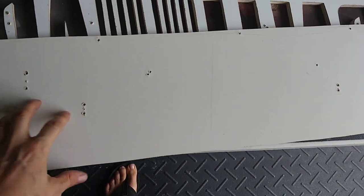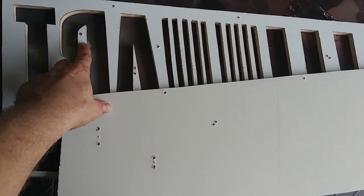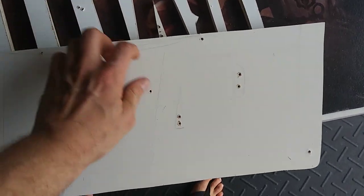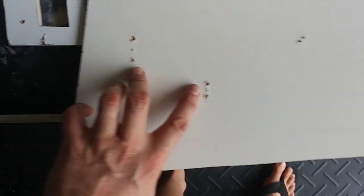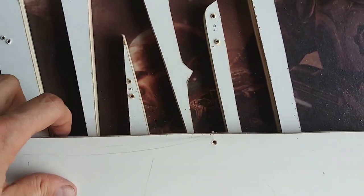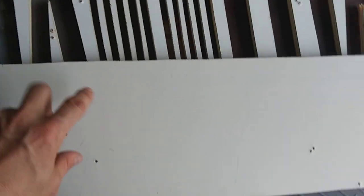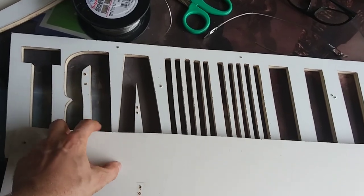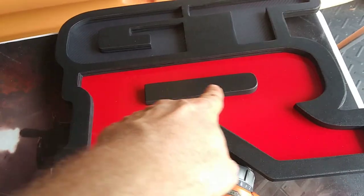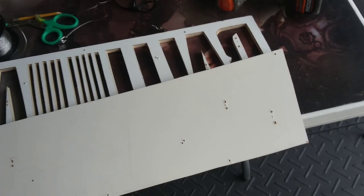One thing I'll show real quick: whenever doing letters that match — sometimes you'll end up with two O's or something like that, but in this case it's AR AR on both sides — what I did is these have two holes for the screws, but I also put a little hole in the middle and flipped it so it corresponds with the other piece. When I sand everything I'll know that these guys go on this side and match the board, because sometimes they'll be slightly off and when you screw it in it moves and you'll actually scratch the paint. So if you have duplicate letters, mark them from the back so you know what's what.